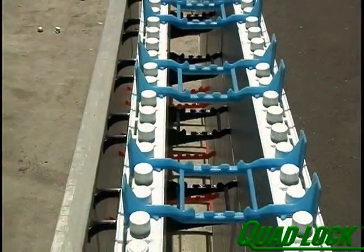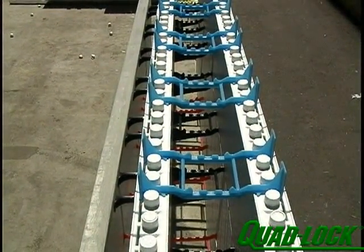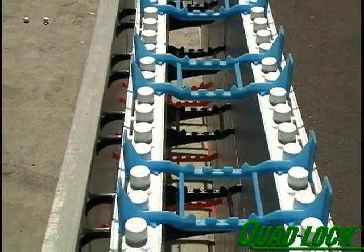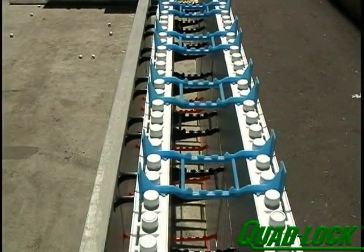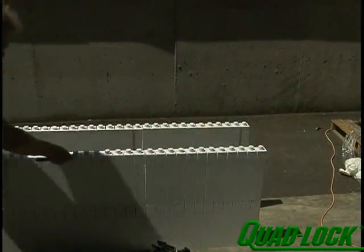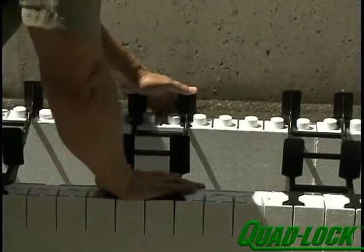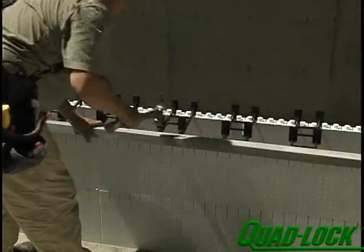A clear advantage of QuadLock is the ability to form brick ledges using the special QuadLock brick ledge tie or by combining multiple wall cavity sizes. If using the brick ledge tie, the lower portion of the wall should be a 12-inch wall cavity or stepped out to 12 inches using QuadLock Plus panels. At the elevation where a brick ledge is desired, cut the knobs off the outside panel and insert the black brick ledge ties at the normal 12-inch spacing along the wall. Secure the outside of the brick ledge ties by placing metal track over the top of the panels and tie ends.